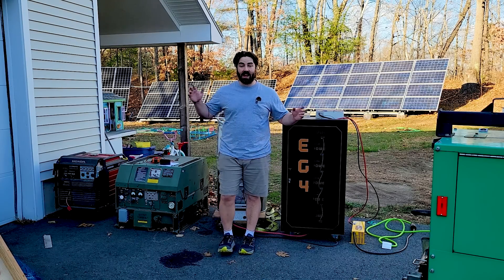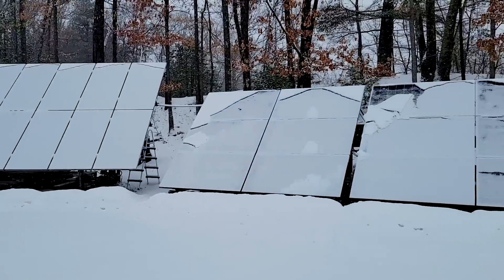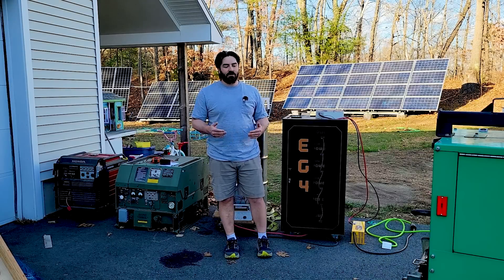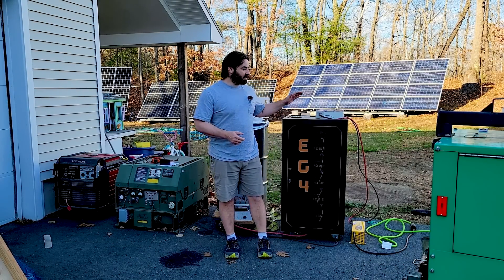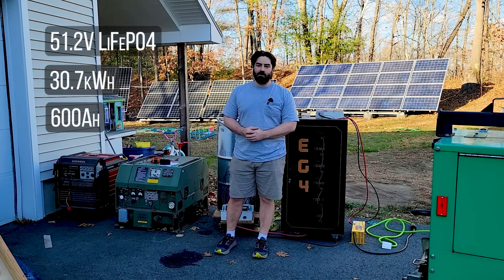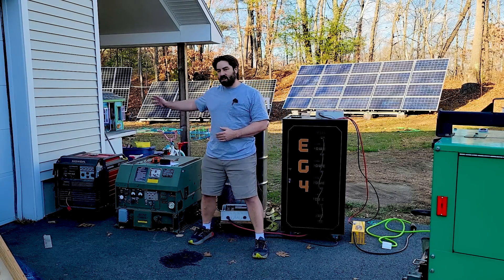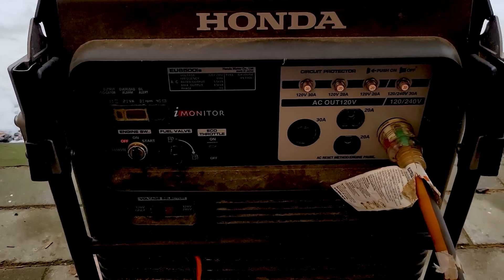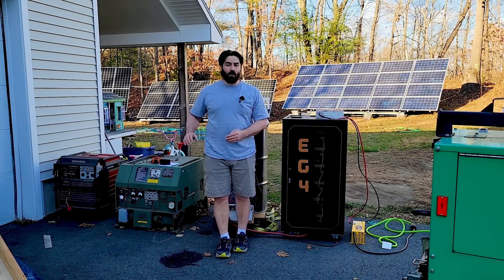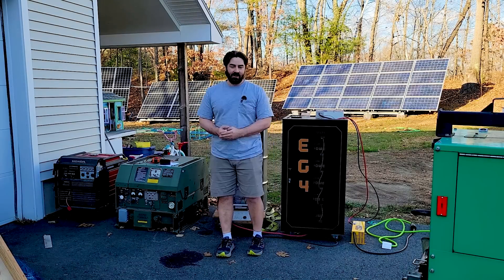I'm David and I'm on a mission to take my house and garage completely off-grid. In January we have snow covering everything, we have weeks of cloudy weather, and we just don't have enough solar production, which means I do have to fire up a generator once in a while to recharge the solar battery bank. This is a 48-volt 30 kilowatt-hour lithium iron phosphate battery bank. In the past I've used the Honda EU6500 — an inverter-driven gasoline generator — and it got an amazing 5.9 kilowatt hours per gallon, measuring the electricity going into the battery bank.